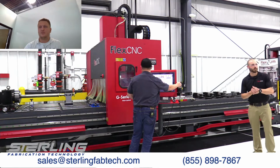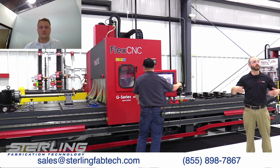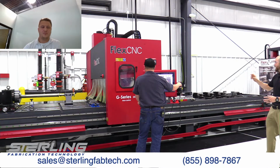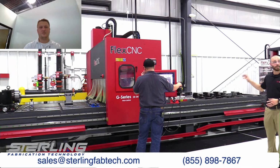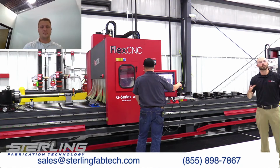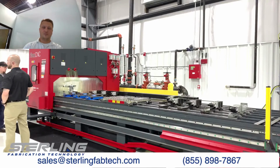And while he's getting that set up, a good point to the fixturing options. A lot of times when you're buying machines along these lines, you have to go and outsource and find other options for fixturing. But on this alone, not only do we have our fourth axis rocking, we have some Kurt vices, as well as some of these pneumatic clamps that are controlled along the bed, as well as some magnetic options that we'll be going to here in the near future. So the options when it comes to fixturing and work holding, I won't say they're endless per se, but you have a various amount of options to be able to do that, and also have a turnkey machine go right into your shop.